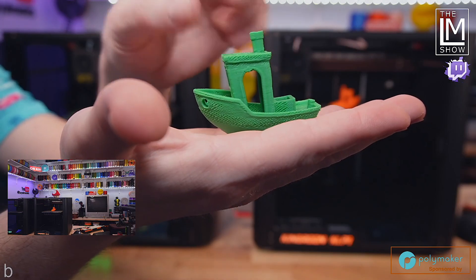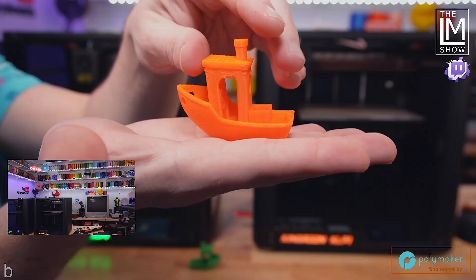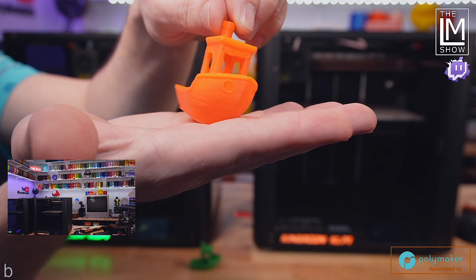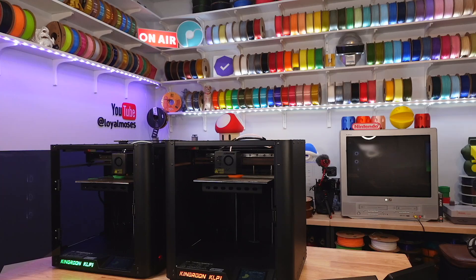But the print results were very different between the two machines. The 210's print had obvious signs of the hot end struggling to keep up with the speed, while the 230 looks very much better — not perfect, but really impressive for an 18-minute Benchy at 200°C for that nozzle temp. Now looking at just how well the 230 performed at that low of a temp, I wanted to run both machines again but this time bump their temps up to 225 to remove temperature as a factor and just see the print results.